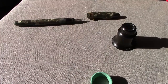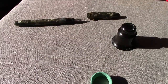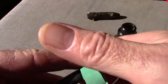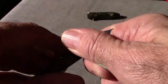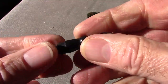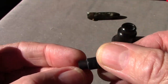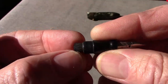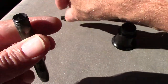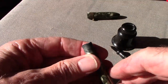I'll let it soak — I could let it soak for days. One of the things I've learned working on pens is to never force anything. So we'll look at the New Banker next. Right away the section moves very easily and comes out cleanly. The first thing I notice is there's no sack material at the bottom of the section — this pen has been taken apart before, potentially to be restored. Looking inside the barrel, there's no old bladder either.